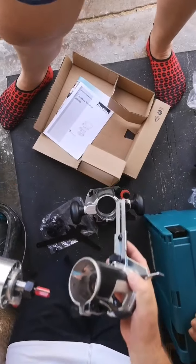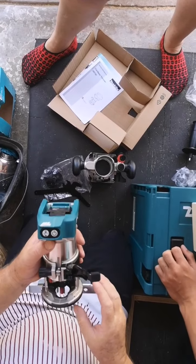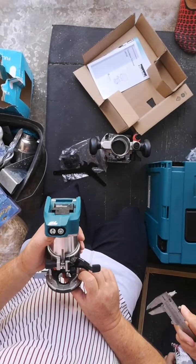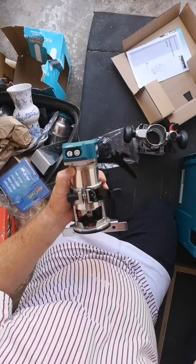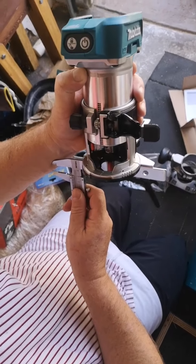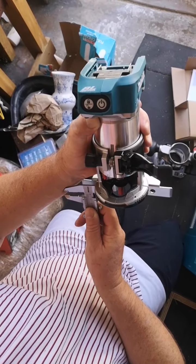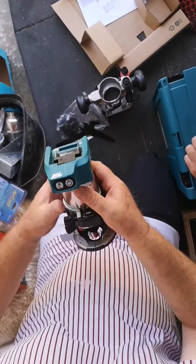Okay, that's tight enough — that was easy enough to do. Then we pop this thing in here. It really does look very nice, very shiny, and shiny is always nice. Okay, you just set it — give me a vernier please. I want to take about 9mm in there, so where is this thing measuring from? If it says there it's 9mm — is it actually 9mm over there? No it's not. So let's look, I want 9mm from there to there. That looks about right already, so I'm going to close it there.